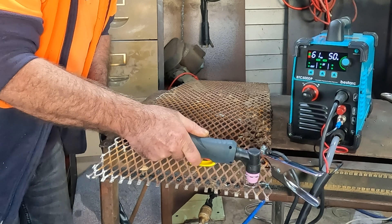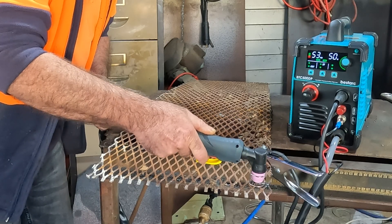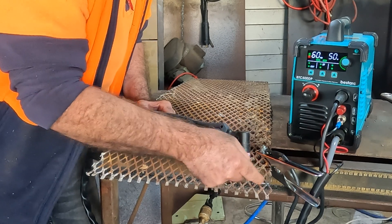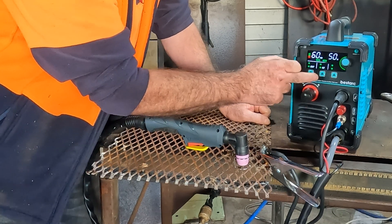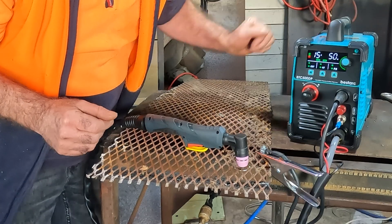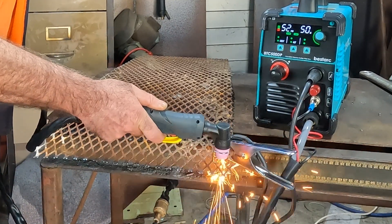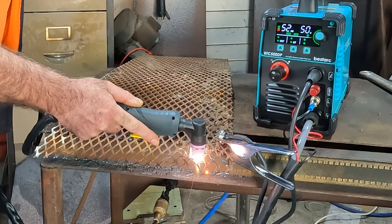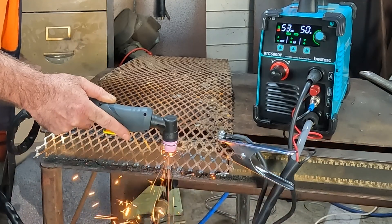See, we're having real issues - see it won't start. And when you get it started you can't keep it going. That's because the pilot arc is going off when you stop touching the steel. So let's see if this works - going from 2T to 4T, pilot arc from one second to 15 seconds, at 50 amps. See what happens now - the pilot arc is just igniting all the time.